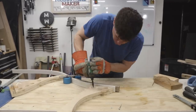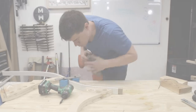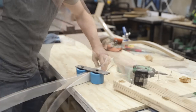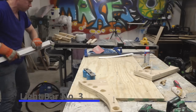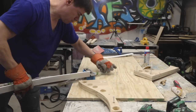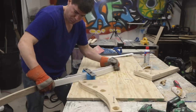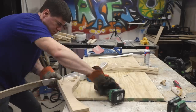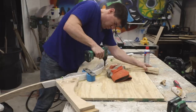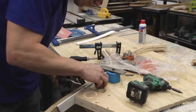There are some drawbacks to this free-form approach, however. It wouldn't be ideal if you're trying to achieve an exact radius or make repeated identical curves. For this project, some variation between light bars was totally fine, so it worked great. Another suggestion from Izzy was using aluminum flat bar as a brace while bending. I didn't have any handy, so I tried PVC trim as a brace instead. It helped a bit, but I still got some small cracks, so I think aluminum definitely would have been a better choice.